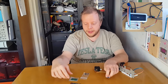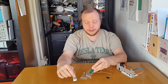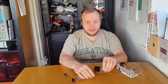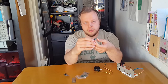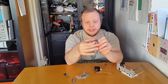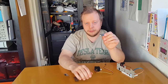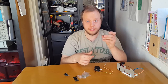I'm going to go about eventually soldering these tiny ones onto some carrier boards and I'm going to try some of the different versions of it. Now if you're new to this game I'd recommend starting with an Arduino, but if you're familiar with the Arduino then this module here — it's called the ESP-01. All the devices in the family are the ESP8266, this specific device is the ESP-01. This is probably the best starting point — although it's only got two GPIO pins, it's going to be the easiest to run with because you don't need to do any soldering.